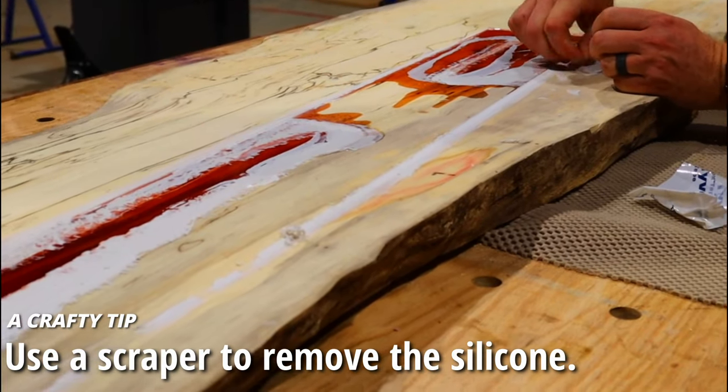By the time we're done with the third seal coat, the slab should be perfectly flat with very few voids. If there are some voids, don't worry — you'll take care of that on the flood coat. Before starting the flood coat, I break out the random orbit sander with a 220 pad and sand the slab very well. Those voids will typically be taken care of by 220 sanding; you can even feather it a little. Be careful on the edges — hand sand the live edge because you don't want to sand through your seal coat. Once sanding is done, wipe down with denatured alcohol or acetone to remove all dust before the flood coat.